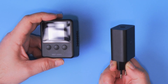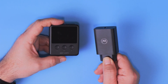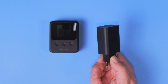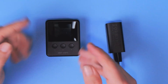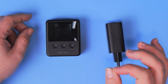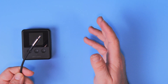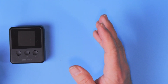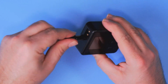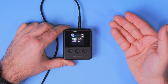This small charger has an output power of more than 68 watts. So why can't I power my travelling LiPo charger from the charger I already own? I don't want to carry a big bulky power supply when I have a high-output charger I use every day. You can finally do it, because this thing can be powered from USB-C. However, over that port it limits the charging output to 65 watts. You'll need a USB-C cable that can transfer up to 65 watts — a cheap cable might not be enough. But with my charger and cable plugged in, after a short info screen showing input power max 68 watts, the charger works like any other charger, only powered from USB-C.